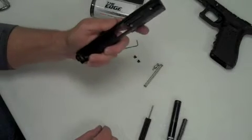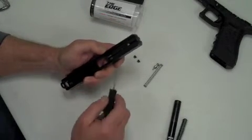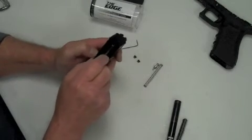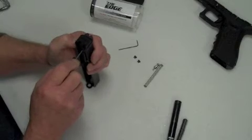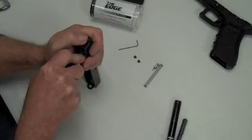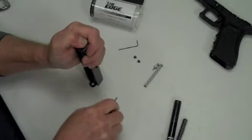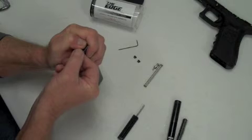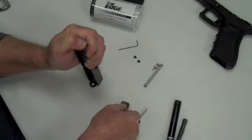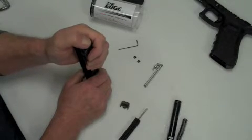So let's take the slide in our left hand. We're going to disassemble this. Underneath the firing pin lug, there's a spacer sleeve. We'll set the slide down, muzzle first on the table, depress that, and then with our thumb, take the back plate and slide it backwards, keeping our thumb covering the rear of that until we feel both the EDP and the spacer sleeve hit our thumb.